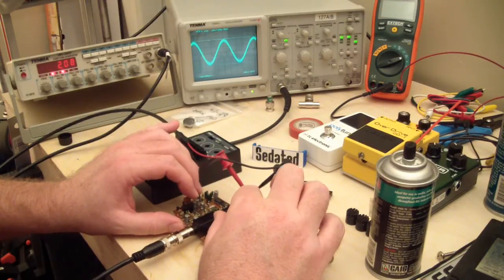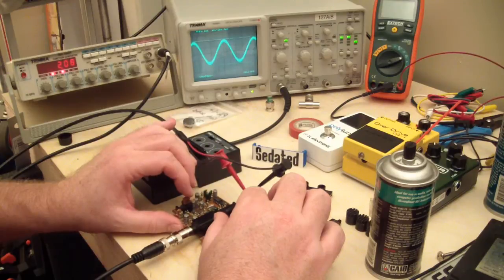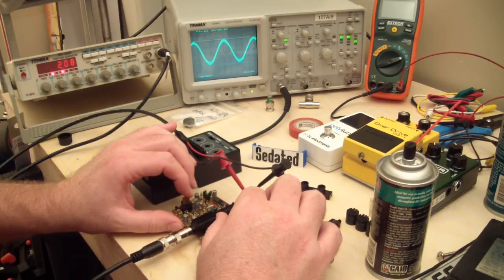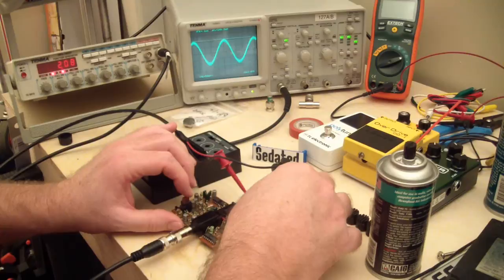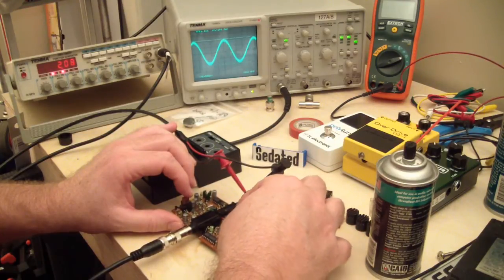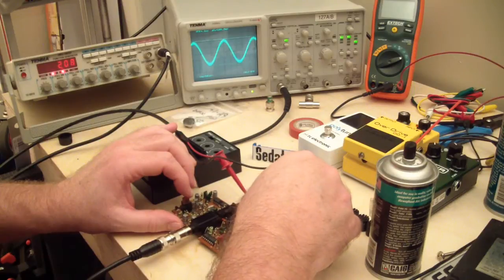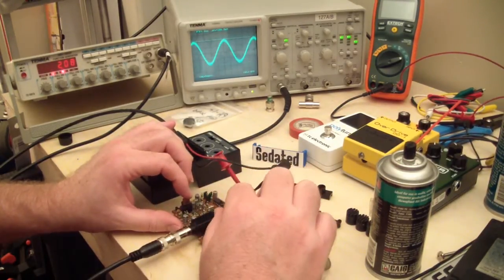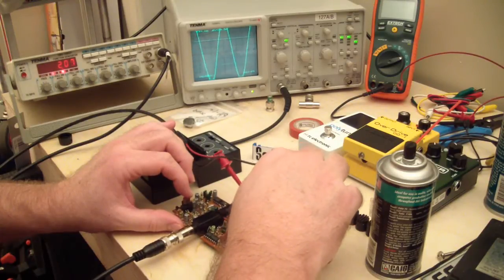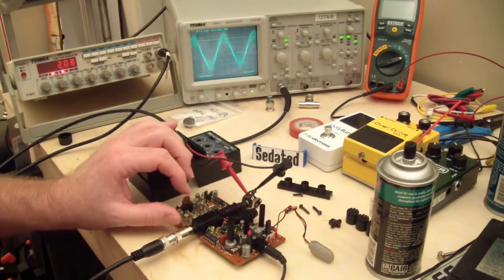It's a kind of pedal that you might want to isolate in a loop if that bothers you. If you've got no noise in your pickups or anything, you won't hear that at all. Like I said, if you have any kind of noise coming out of your guitar, it's going to amplify that later. It seems mostly to be from the depth control. It's causing that. If you back it off, it goes away. But it definitely responds to the speed. So not a very clean bypass on the SCH-1, but oh well. Nature of the beast. Alright, let's play test it.